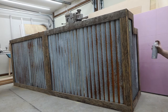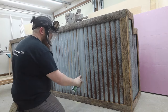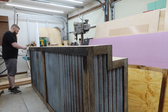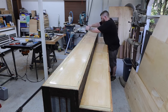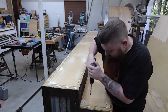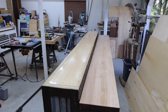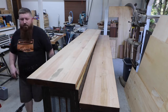I removed the footrest and used clear gloss lacquer on the corrugated metal to seal everything in. I drilled a bunch of holes in the top of the carcass and brought the tops in. I already stained and sealed the bottoms. The stain probably wasn't necessary with the exception of the areas that overhang, but it's 100% necessary to seal all sides of these tops to prevent them from warping.